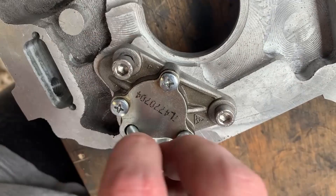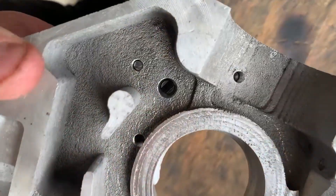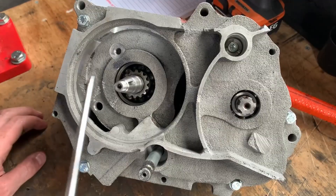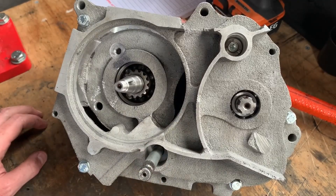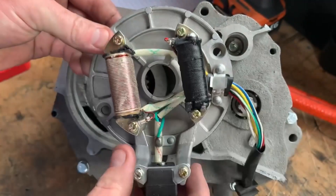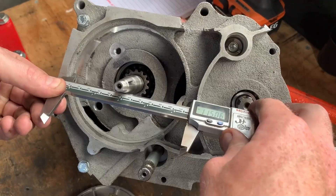She's all nice and snug. You can see the backside where the oil pump is driven by the oil pump drive shaft. Also because I interpolated this bore here, it is actually pretty average and I'm also not quite sure how round it is. I do have a bit of trouble placing this in here, so we'll give it a quick measure.